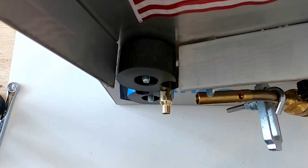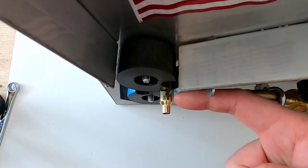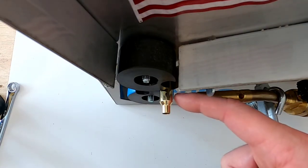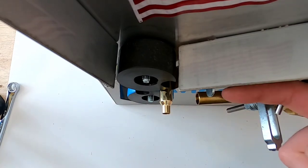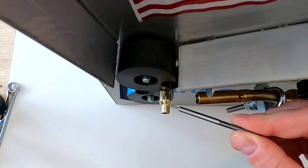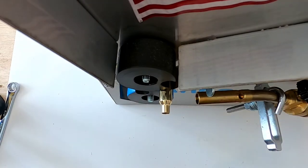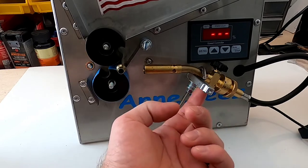Next, the torch positioning needs to be adjusted. If you look here, I've got one piece of brass sitting on the machine. The torch is actually pointed pretty much right at the main housing of the cartridge, and if I were to run it like this, it would be annealing the main housing and not the neck and shoulder. So I'm going to take the torch tip and bring it out so that it's aiming right at the crease where the neck turns into the shoulder — that will get the shoulder itself annealed and the case neck. To do this, I'm going to loosen this nut and then slide the whole holder out in the slide slot.